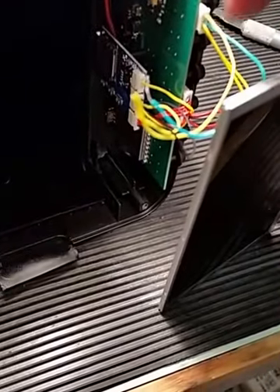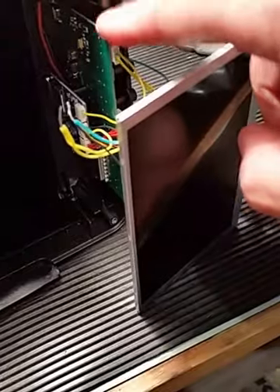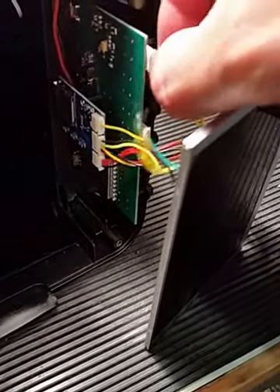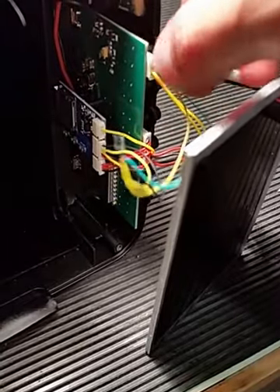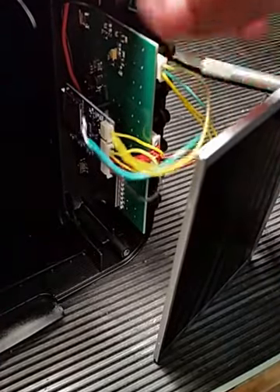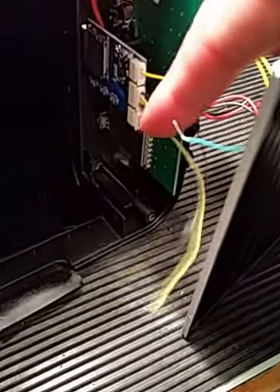Funny enough, they don't have it wired from the factory. There are some videos out there on the internet that show you have to wire from the main board to the DVR board. There are two mods people show: one is to take two wires from the main board and go to an audio jack to give yourself headphones, which I'm going to do. But if you also want to record that sound, you need to take that signal down into the DVR board.